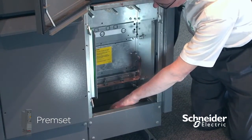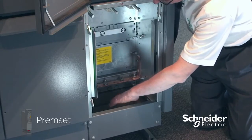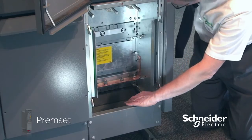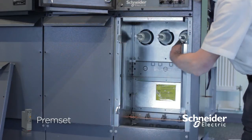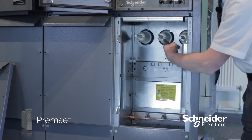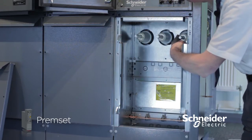The gland plate has two positions — lower or raised — depending on the type of cable: 3-core or single-core cable. It also features a Type C profile bushing that will allow for separable connectors, heat shrink, or cold fit boots.